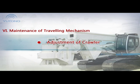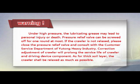Adjustment of crawler. Warning: under high pressure, the lubricating grease may lead to personal injury or death. Pressure relief valve can be screwed off for 1 round at most. If the crawler is not relaxed, please close the pressure relief valve and consult with the customer service department of Yutong Heavy Industry. Correct adjustment of crawler will prolong the service life of crawler and driving device components. As for a thick soil layer, the crawler should be relaxed as much as possible.